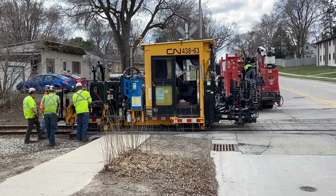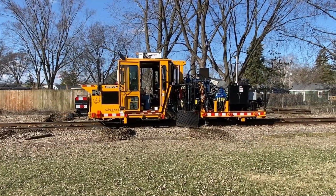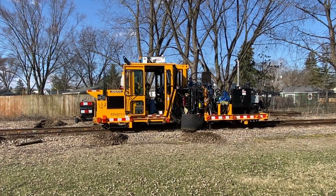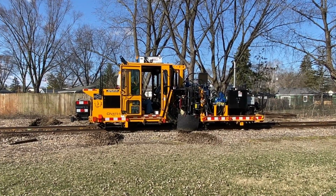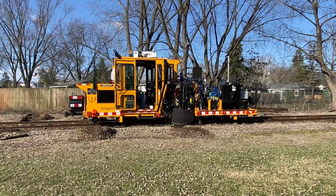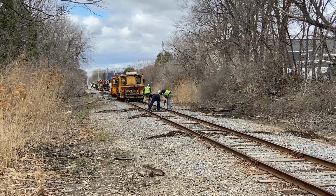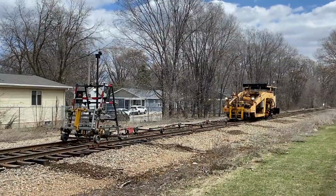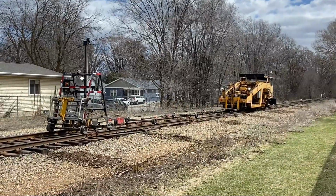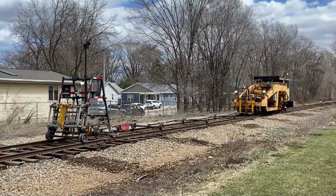A stop is made to stock up on supplies, different sized tie plates in this case. Spiking is next, probably the loudest task. Bringing up the rear are the guys installing the rail anchors. All this work has disturbed the track structure, both functionally and cosmetically. So behind the tie gang will be a surfacing gang, who will ensure the track structure is level.